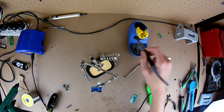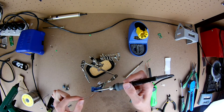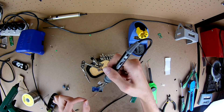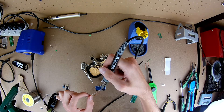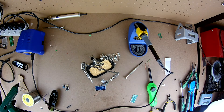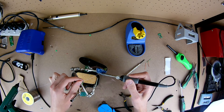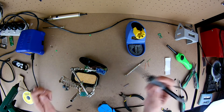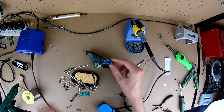Once all the wires are done, connect them to the Arduino. Power goes to the 5V pin on the Arduino — that's quite important. Connect the two signal pins to A0 and A1 on the Arduino, and connect ground to ground. If you're using a circuit board you may handle ground differently, but otherwise connect that line to a ground pin on the Arduino. For the buttons, there should be a red, a black, and a white wire. The red and white are signal and go into pin 2 and pin 3; the black wire is ground and connects to any ground pin on the Arduino.